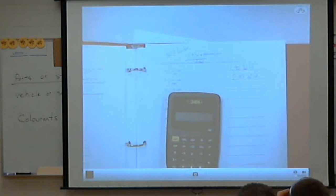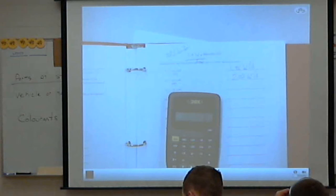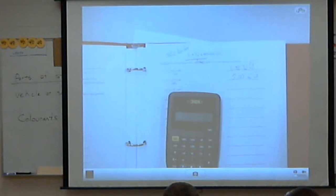Any questions on board feet? It's just length times width times thickness divided by 144. Don't worry, this isn't homework. We'll have it due Tuesday. So if there's downtime, if you're waiting for a machine, you can work on that.